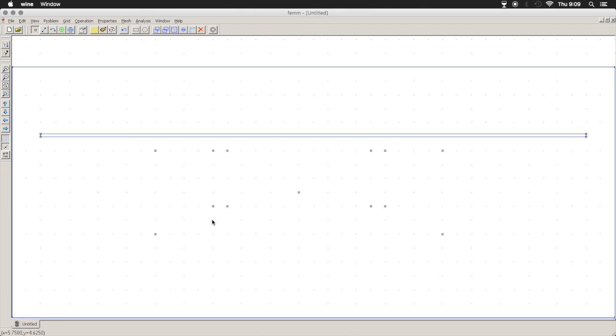Then we have our material underneath. I'm going to make our active poles here, so the adjustable pole pieces will be here. So we have our iron underneath here, and then that's just a spacer underneath here, so we will leave that blank. And then we'll define our magnet underneath that. So the magnet is going to be in contact with the steel bar and our spacer, and then here's the bottom of our pickup along here.